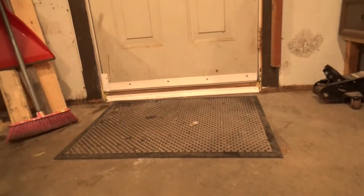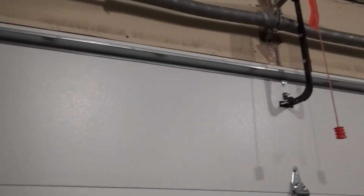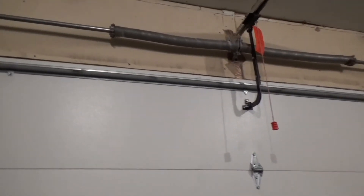I put together some simple math calculations for the average do-it-yourselfer. The calculations are based on two-by-four walls with two-by-four insulation, and assuming you have fixed all drafts. The most common large draft you get is along the sides of the doors, down underneath, and up top. Best way to check: come in during the daytime, turn all your lights off, cover any windows, and see if you can see any light coming through.